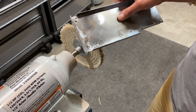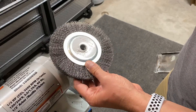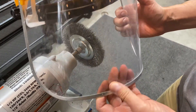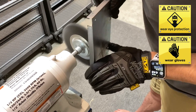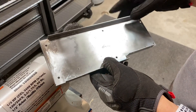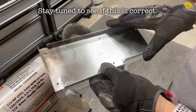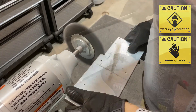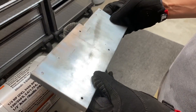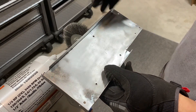We're definitely making some progress. I'm getting curious how a wire brush might work, so I'm going to quickly swap out for the wire wheel and gently touch it to see if this works better or if it's going to be too aggressive. Just note that when you're doing this, it's a good idea to wear eye protection such as a shield. The steel brush is removing the surface corrosion much better than the polishing — this was a little bit deeper than I thought. It seems to be working well and it doesn't seem to be removing the galvanized coating, so we'll still have a nice galvanized finish. It looks pretty good — we've cut down a lot of that corrosion. I can't quite get in with this wheel on some small pieces, so I might have to do those by hand. I'll clean this up and show you what it looks like, then get going on the other parts.